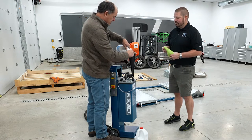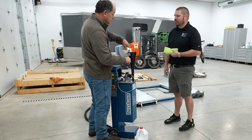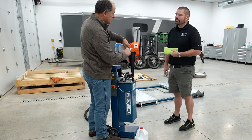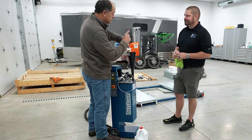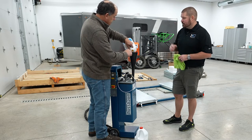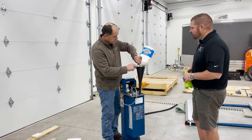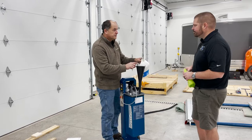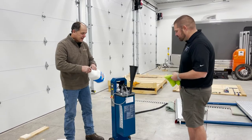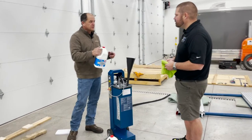But you've got valves in here, these down valves. When you press the down button, that valve has about a 16th of an inch of stroke to it. It's a very minute thing, so if you put thick oil in there, it doesn't want to work as fast. Likewise, a lot of people will tell you that you can put ATF in a lift because it's the same as hydraulic fluid. But would you put hydraulic fluid in your automatic transmission? It's not the same. The viscosity doesn't seem to be the same as ATF, and the valves just don't seem to like it.